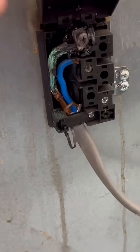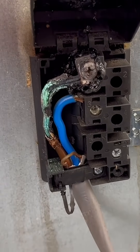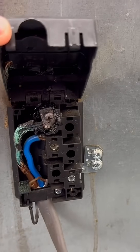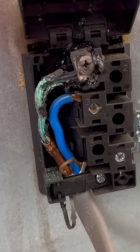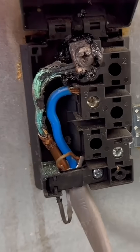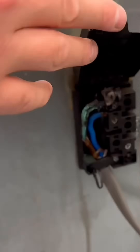Taking another look at it, if we were going to suggest a code, we'd like people in the comments to do it for us and link to what they think in the regulations. Brand new ovens now come with torque settings and appropriate torque screwdrivers, which would hopefully overcome this. It's a tough one — you could say C1, but is it immediately dangerous? It's not currently on fire. The test results actually tested fine, so the connections still tested okay. I imagine it's welded itself to the point where it's very tight.